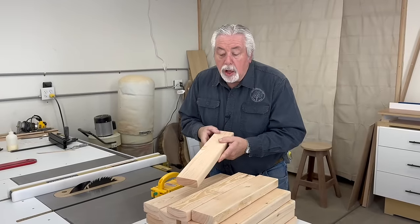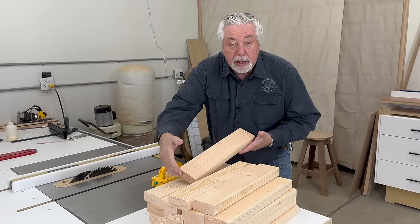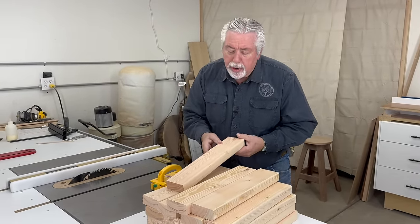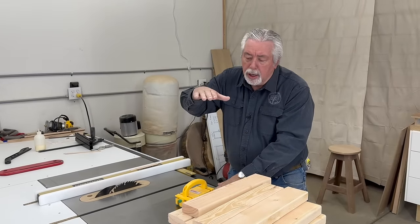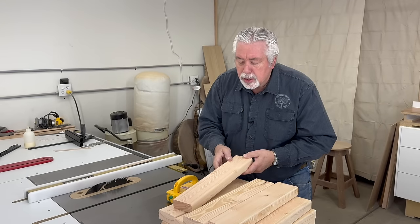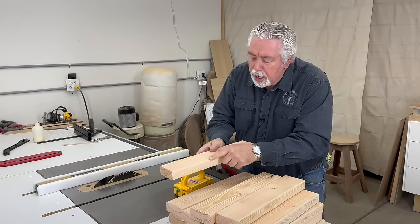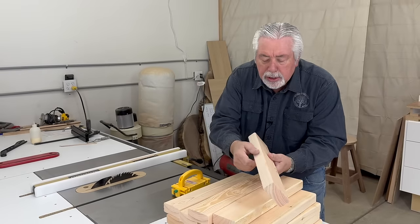With our side pieces all cut to 17 inches in length — they're three and a half inches by one and a half inches by 17 inches right now — I want to put a smoother edge on the outside edge in order to do that little detail I'm going to show you later on. We're going to cut this down to three inches. Our sides are going to be 15 inches tall, so five times three will make our sides. I'm going to take one cut on one side, taking off the mill end, then turn it around and cut it to three and a quarter, turn it around, cut it to three and take off those two sawmill edges.